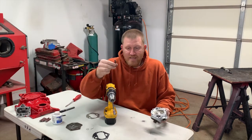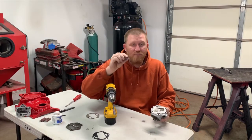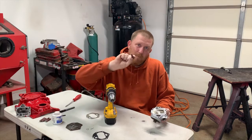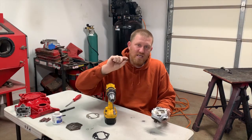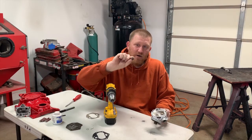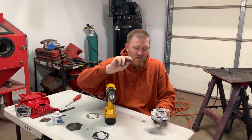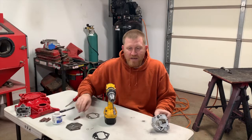But the only reason I started with this one is you have to have enough room to get this conical roll down in there to try to bend it up and around that turn. Once it gets caught on the edge of that turn, the sanding roll here will take care of any of the clearance issues that you have, and it'll keep opening it up.